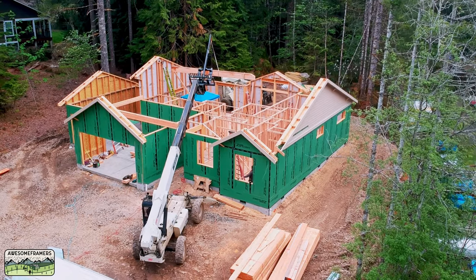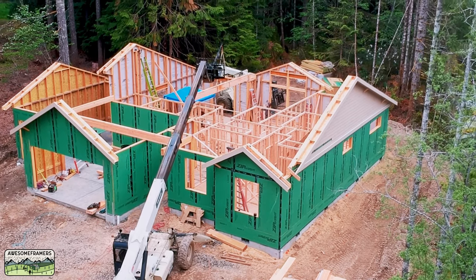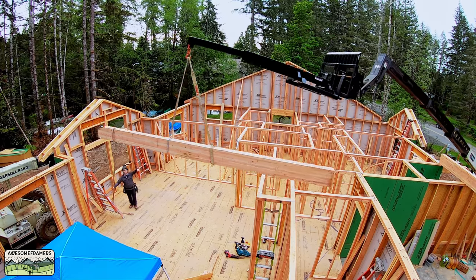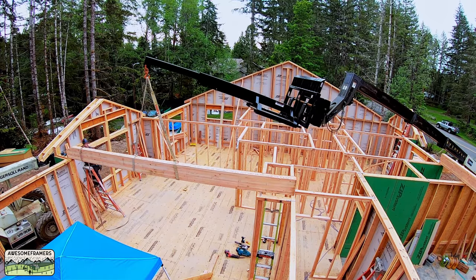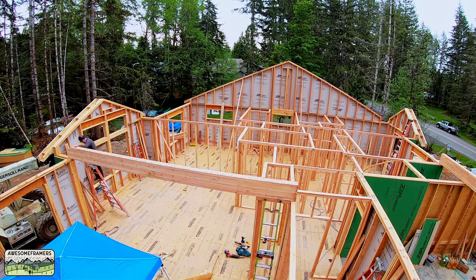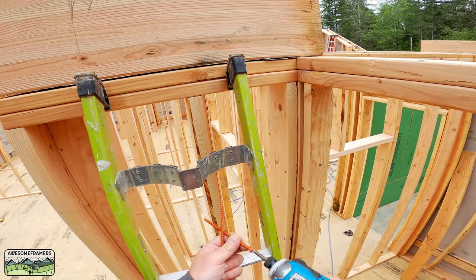A big part of this video is setting all of the beams that either support the ceiling, the rafters, or both — plus the ridge beams. This beam was a five-and-a-half by 15, I think 22 or 23 feet long, running front to back to support the vaulted section with rafters landing on top. With just two people, sometimes Kyle can see me and I signal with the tagline; other times we use our wireless Bluetooth earbuds — we like the IsoTunes Free. There's a coupon code in the description to save 10%, and they're just very easy to use for hands-free communication.